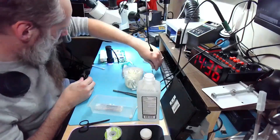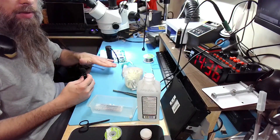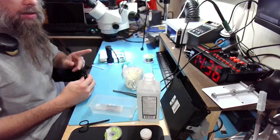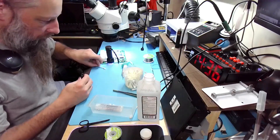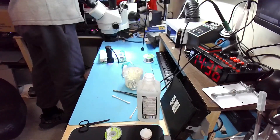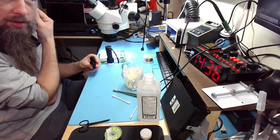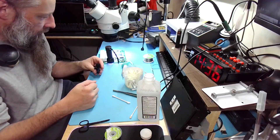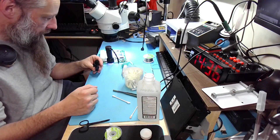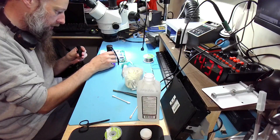All right friends, that will do. I put a little bit more solder on the ground pin, which causes the chip to be a little bit higher than normal, and that's why I struggled with some of the pins. This is the first time I'm doing it this way. Normally the ground pin is starved, but even if you didn't put any solder on that ground plane, there are still five or six pins on that chip that connect to ground — I think that is quite sufficient, so this is not something I worry about. I think this will work just fine.